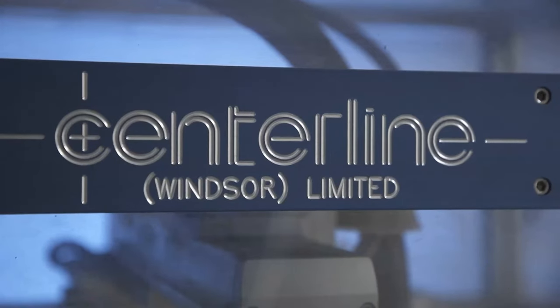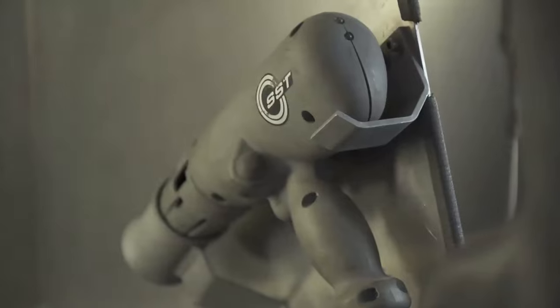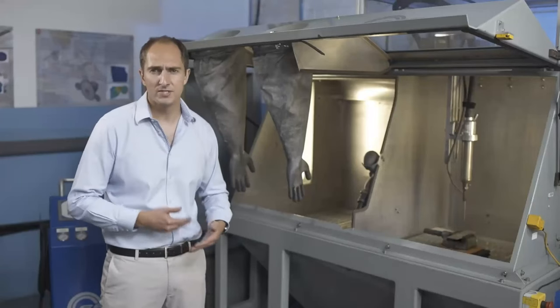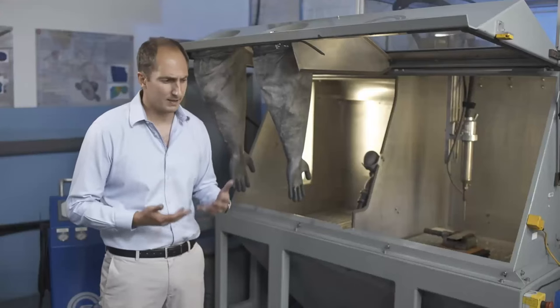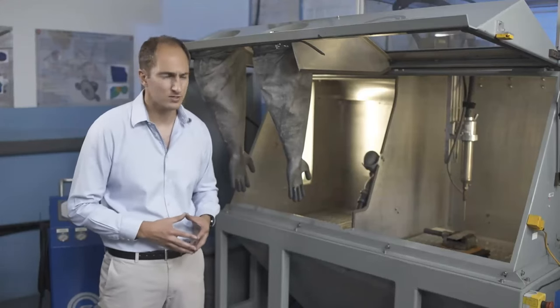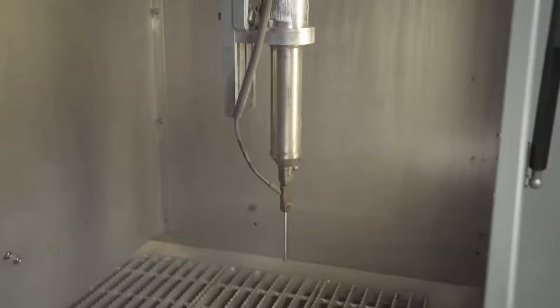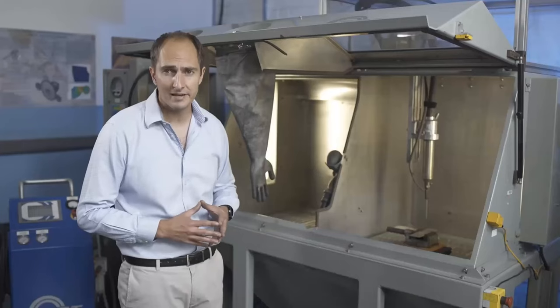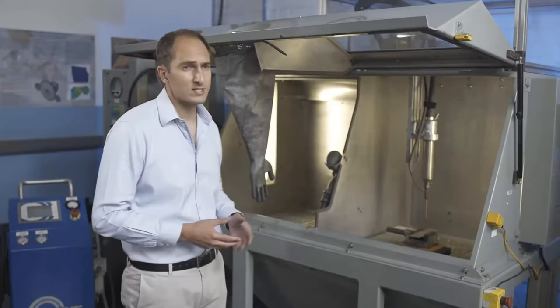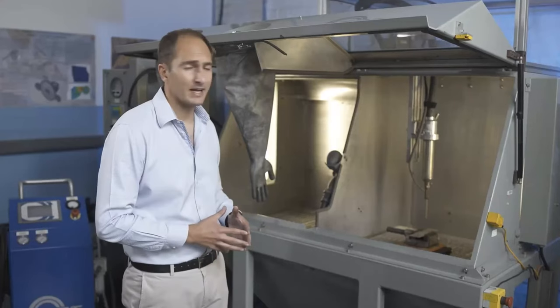The cold spray machine has two distinct booths. The manual handgun sits in one booth but is not often used because you can't accurately create an offset from the substrate — and offset is quite important for reproducibility of results. On the other side is an automatic gun that uses an xy-coordinate robot moving in the x and y plane, with manual offset adjustment via screws.